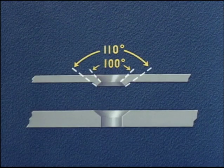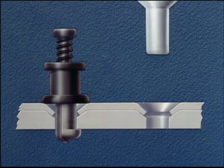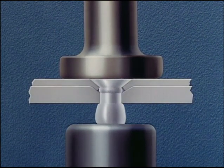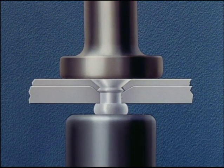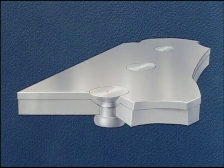The angle of the countersink is also 110 degrees. Parts are reassembled using sheet metal clamps. The rivet is inserted, followed by driving the rivet using a standard flush driving set and bucking bar. This riveting technique is fairly simple because there is no lip on the under sheet to cause cracking or failure from clincher rivets. We have just demonstrated the combined countersink and dimple method of flush riveting. This combination is used in cases where the sheet next to the rivet's manufactured head is too thin to be countersunk and the bottom sheet is too thick to be dimpled.